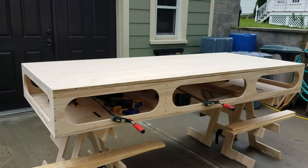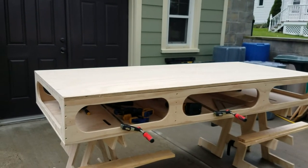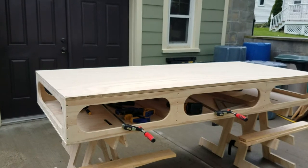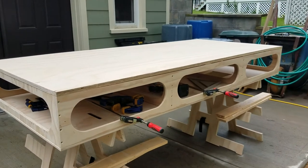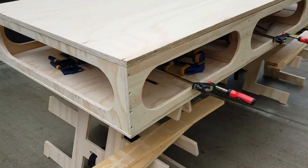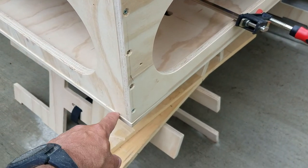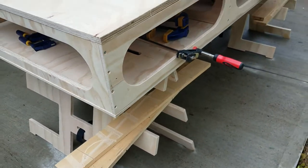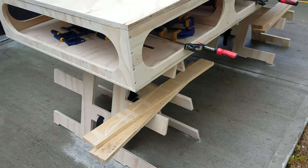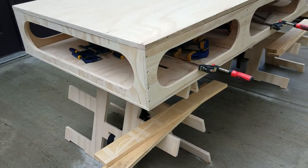And it is a tiny bit smaller than the bottom, which I'm okay with. If I can't have a perfect match right off, at least it's something that I can sand down. So you can see just down in here, just a little bit of a reveal — you're talking maybe a sixteenth of an inch or less. And a belt sander certainly will take a majority of that down.